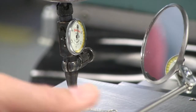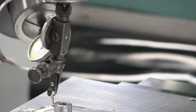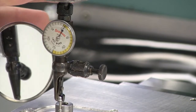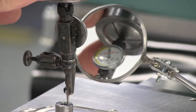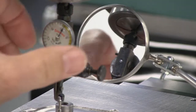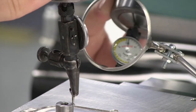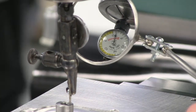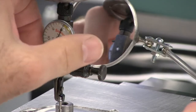I'm just going to let you take a look — we're at zero on the indicator right now. And as I rotate around onto this side, I am zero here. I'm about three quarters of a thousandth off there; I might have to make an adjustment. So what I'm going to do is move my dial and just go to zero here. I'm about a thousandth off — I'm always splitting the distance. I went the wrong way there for a moment, for about a half a thousandth. Re-zero.